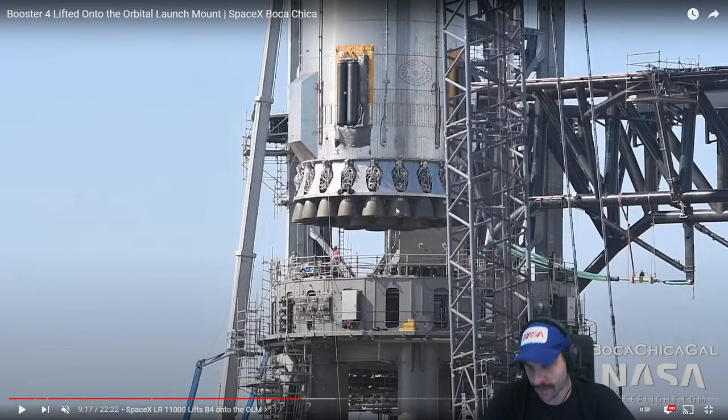And good specific impulse? Yep. They're making somewhere between 350 and 380 seconds, depending on the version of Raptor. 382 seconds specific impulse. That really has more to do with your propellants than anything. 380 is still very good for a methane engine. That's really good, but you theoretically can't get above 380 with methane because chemistry. You're getting to the limit of the physics there.